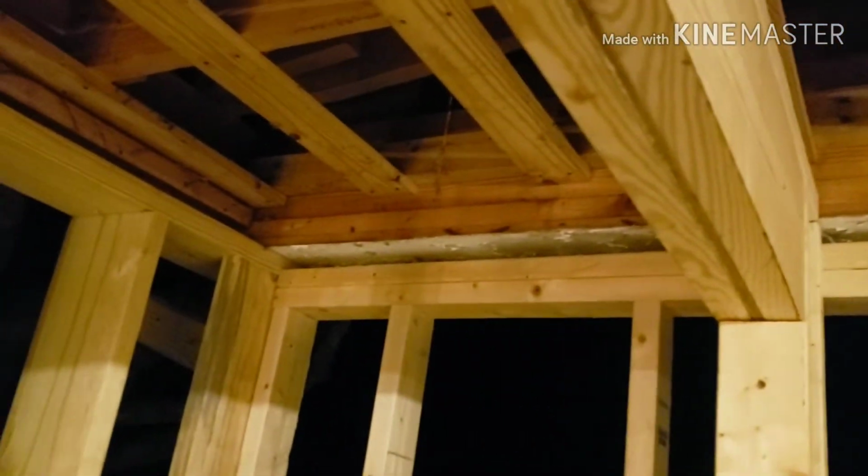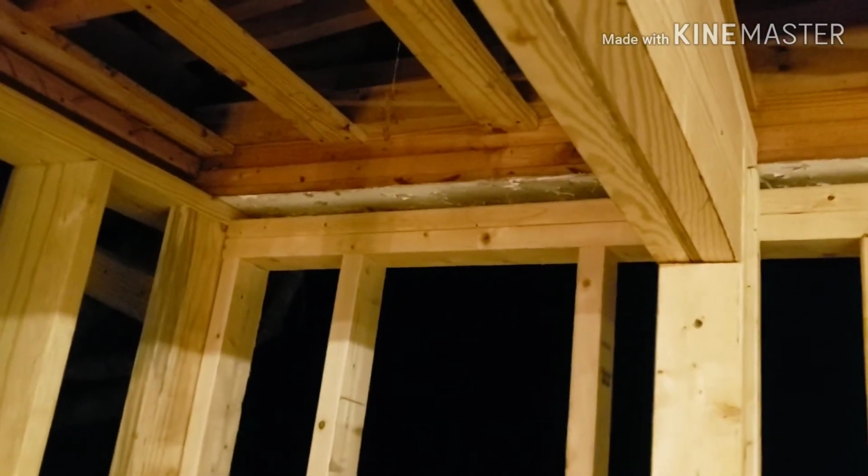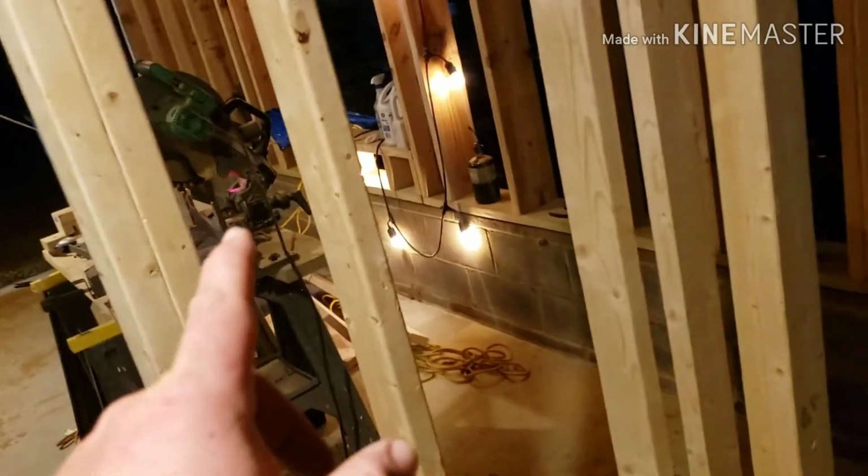My concrete guy or something, I don't know, it's touching the wall down there. And I built it the same height. And I got a good inch and a half, almost 2-inch gap on this end. And then when I measured this wall here to that wall, that corner down there, it's right at 1 inch off. So I know the concrete's off some.